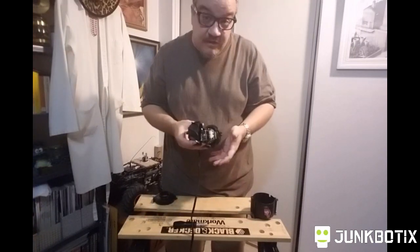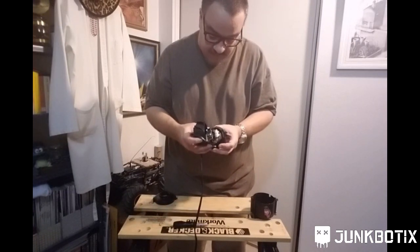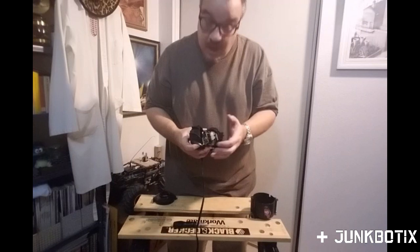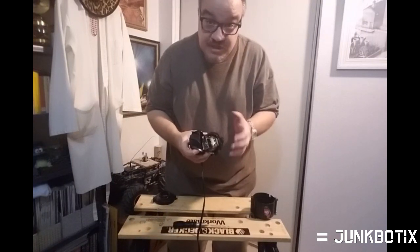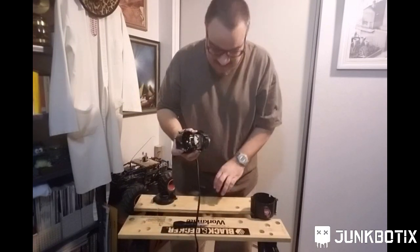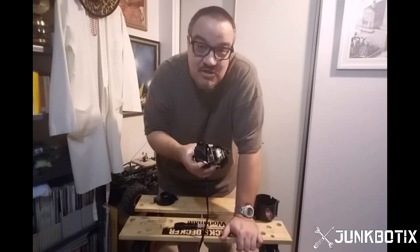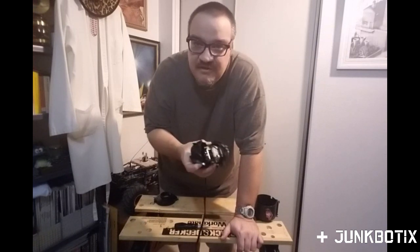This thing rotates really smoothly. Rather than being a permanent magnet DC motor, it actually runs off AC — but due to the commutator it's basically switching that AC around so it operates in a DC way. There are plenty of resources online to learn about universal motors and series motors.